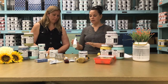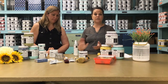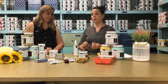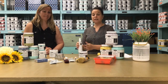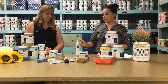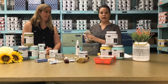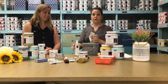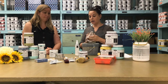After that, come in with our cleaner and varnish remover. It's in a spray bottle — spray all over your surface and allow it to work for about 30 minutes. If you'd like it to work a little more, spray a bit of water on top to reactivate the cleaner and help remove those previous layers. Then take a pail with a cloth and warm water and remove any of the cleaner you just applied, taking off any grease, dirt, or previous product on your furniture.